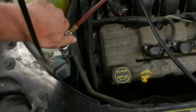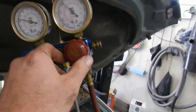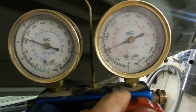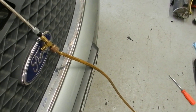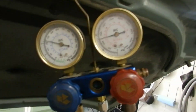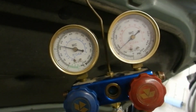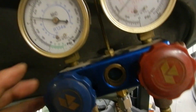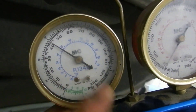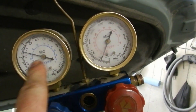Now I will disconnect the high side, and then we will take the high side and bring it into the low side. I've got to flip the hose — the valve is on the wrong side. I need that on the other end of the hose so it doesn't come out. So we've got the high side open, now we open the low side and watch what happens — the low side sucks the high side in. That way we can drop the pressures on both of them.